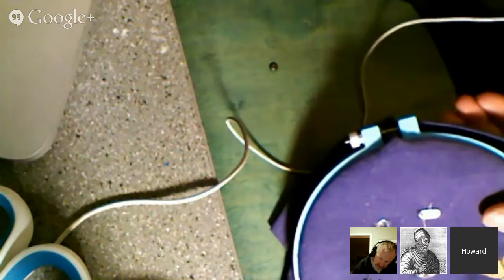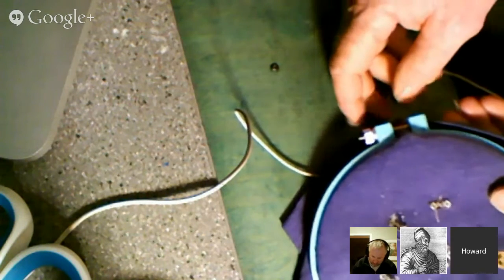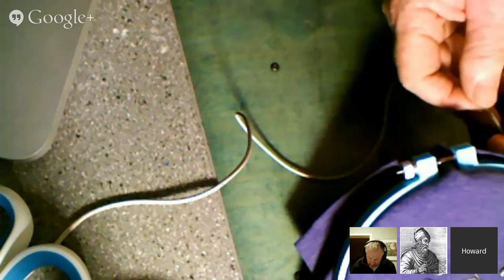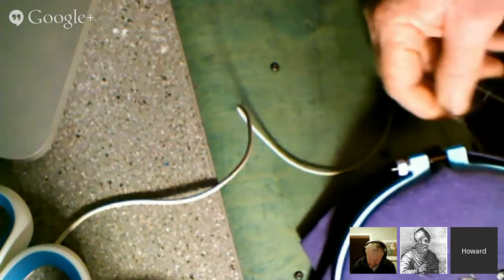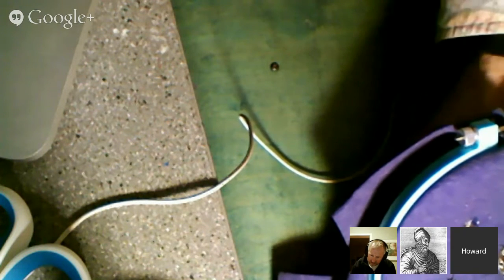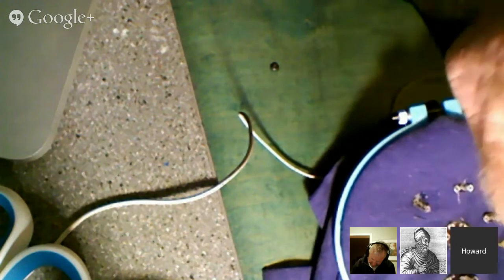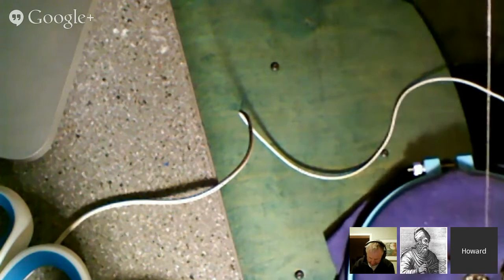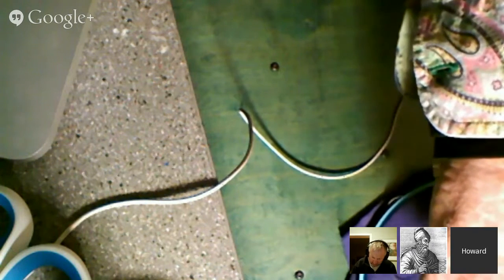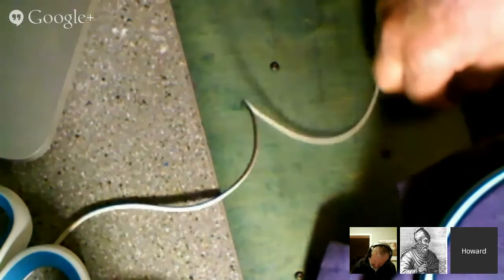One thing that I had not known about was the way wood expands. So if you're going to make a box, you need to have the top and the bottom in a kind of slot where the wood can expand and contract without cracking things. So that's where a router comes in. You make these grooves and you make everything fit in, and then you glue it all together. And then after it's glued together, you make a top by sawing it off with the table saw.